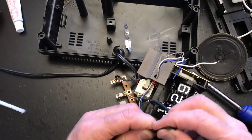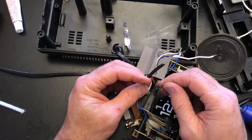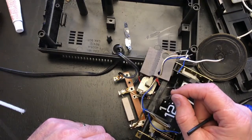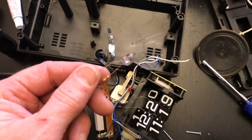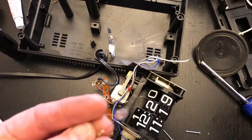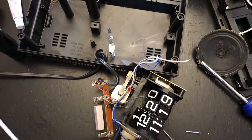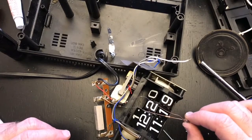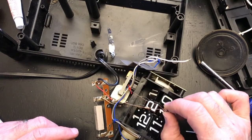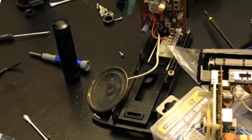When I remove the tubing it reveals a really long lead underneath, and the resistor is way down low. I find out it also has a resistor on it, which is strange — I've never seen that before. Here's the replacement bulb I got from eBay — surplus from somewhere — it's about the same size, a little smaller, but puts out really good light. I've got the clock energized and you can see it flipping — just testing to see it'll run.